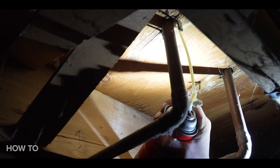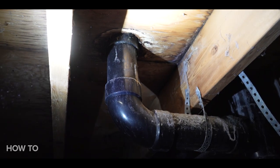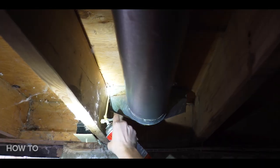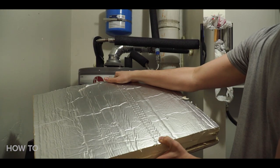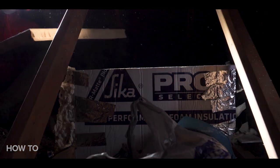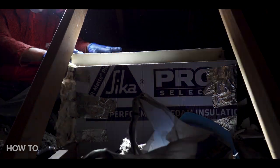For areas where there's a bigger gap or opening, or there are wires and it would be awkward to apply caulk, we're going to use canned foam instead. To use the canned foam, simply attach the nozzle to the top — handle with care because this will not come out of your clothes or your carpet. Leaks in your attic or crawl space are the most important areas to address, so we're using canned foam on openings around pipes, vents, and crevices in our crawl space and the tops of the interior walls in the attic. We've also added a piece of foam board to the top of the attic hatch and weatherstripped the trim of the hatch. If your home has a whole-house fan, sealing it up in the winter months is as easy as building a box out of foam board and canned foam — just weatherstrip the lid of the box and it can easily be removed in the summer.